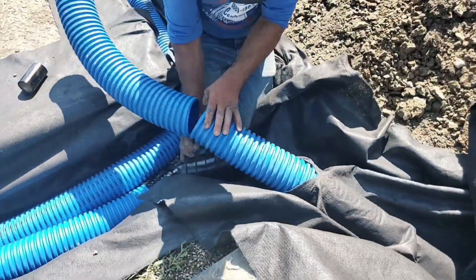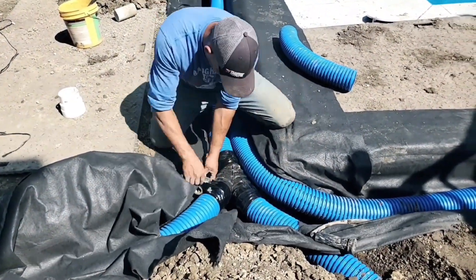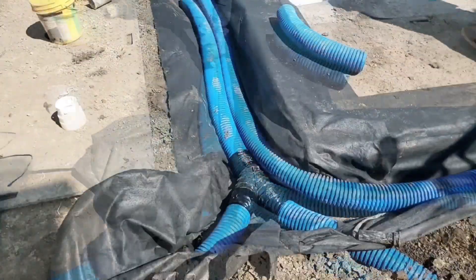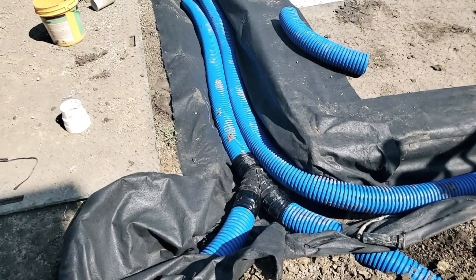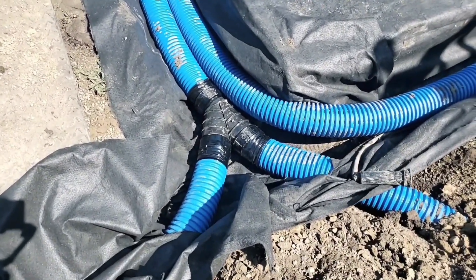In a bed of stone. When you're running a roof runoff system, you want a solid pipe. You want to capture all the water and you do not want to let it go. It is next to impossible to gather up all that water if you let it go too soon.